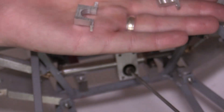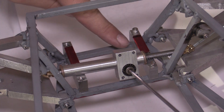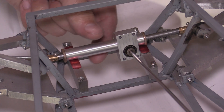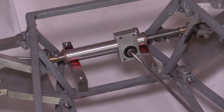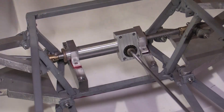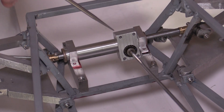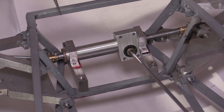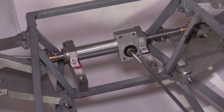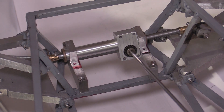We now have the clamp and brackets made for securing the rack in position. I've put some marking fluid on the support and I'm going to sit it in position where I decided I wanted it to go. All I've done is scratched a reference line so I know where to drill the holes to hold these brackets in position. I can disassemble this now, get those brackets back out, drill the holes in the brackets, tap them, and we still have that recess to machine in that support as well while we've got the parts out.